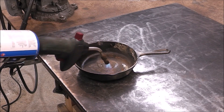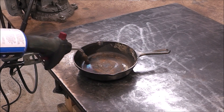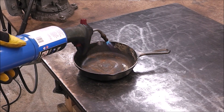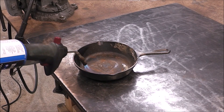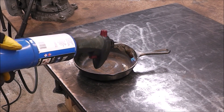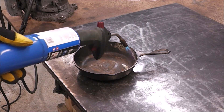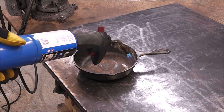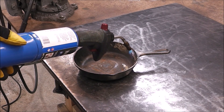I'm just trying to get this heated up so that the temperature change — when this is sitting at room temperature, it's probably 68 degrees right now. As soon as you put the torch to it and you start welding on it, it goes from that temperature to welding temperature, which is thousands of degrees, and that's what shocks it and it has a tendency to want to crack. If you can heat this up — the more you can get a little bit of heat in it, the less of a temperature swing it has to do.